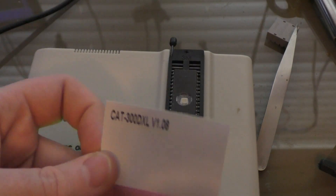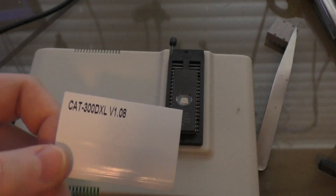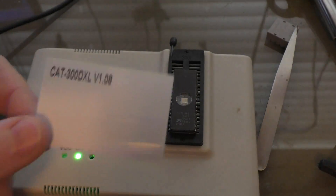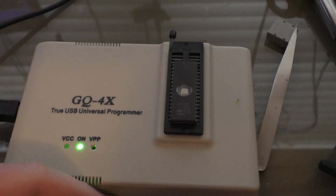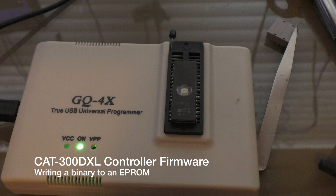And that'll be the upgrade for the TARC CAT300DXL controller. I know I'm not a fan of controllers because I like using AppRPT, but it's what they want to do — it's not my call to make. That's how you write an EEPROM for a repeater controller when you have an EEPROM programmer. These little programmers are great and fairly inexpensive. They have sockets pretty cheaply too, though some of the sockets can get to be as much as the programmer itself because they're very customized. Thanks for watching. This is Brian Fields, Amateur Radio call sign W9CR.